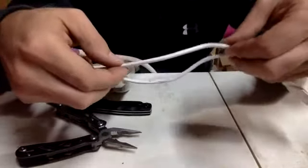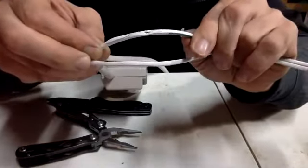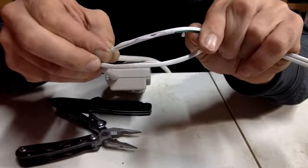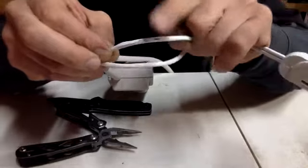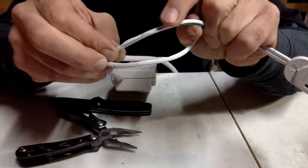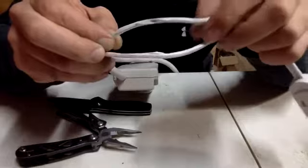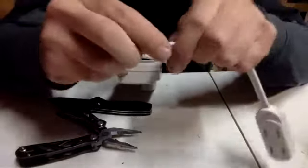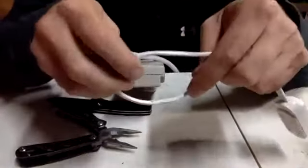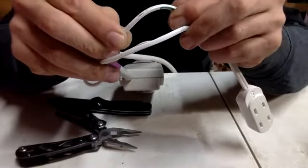This is where a lot of people might go wrong. All right. I'm no different. But you see how I accidentally sliced into that wire? Sometimes that little spot right there, that's a bare copper wire that I just tapped into. Okay. Sometimes when we tap into that wire, we're cutting into this stuff, it will cause it to short out, because we went to wrap it together and we don't realize that we've exposed that copper wire. Okay? So it's very important that you guys pay attention that you're only cutting the plastic.